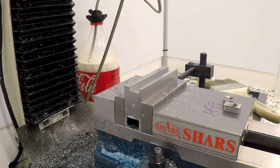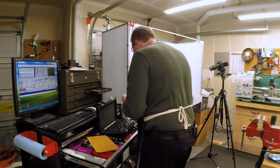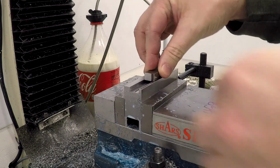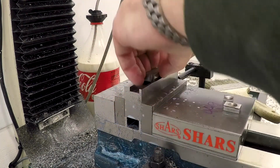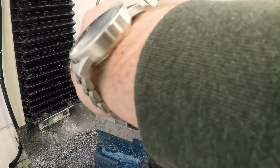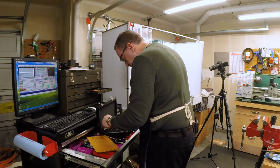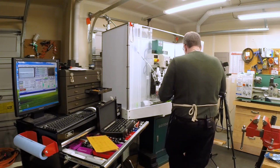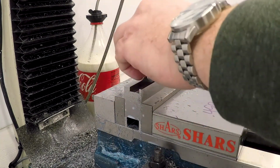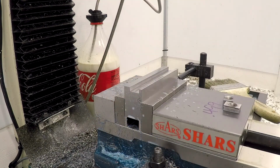So if we want to stack up a 501, we'll take the 400 plus 101, and that is very tight. It almost goes in. So we're actually somewhere between 500 and 501, which is exactly where we want to be. Let's see exactly where we did get to. Let's take 500 1/2. That will go to the bottom, but then it's in there, nice and solid. Okay, looks like we're about 500 1/2.